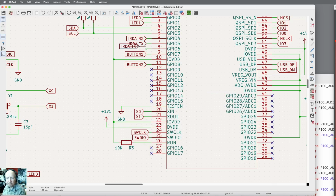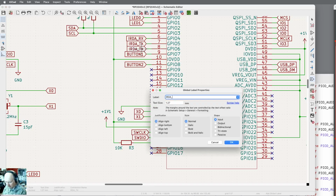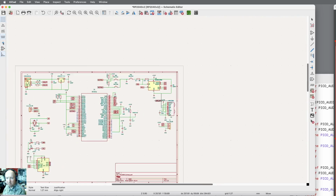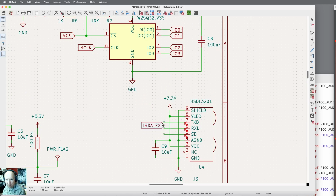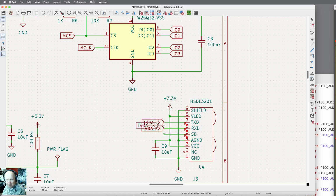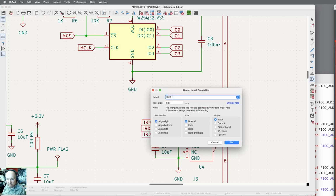And there's actually one called SD, which is disable. So we can actually shut it off so it doesn't do anything, and takes less power that way too. So, okay, now I need those to go directly over. I want to duplicate that, zoom out, zoom in. That's the RX. Duplicate. Edit. This is the TX. Duplicate. Drop it in there. Edit. SD. I can't type. SD.